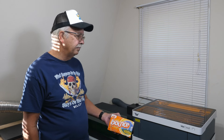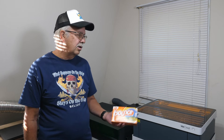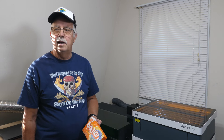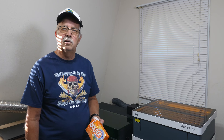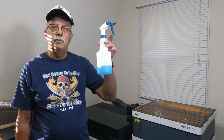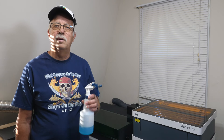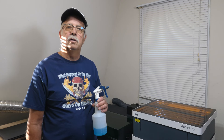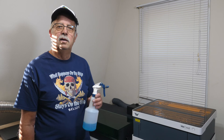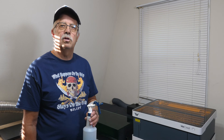When you're doing cutting with a lot of smoke and vapors, the acrylic is going to cloud up on the inside — both of them have that issue, same as my laser enclosures. Easy fix: use your favorite glass cleaner, a paper towel — make sure there's no grit or you'll scratch the acrylic — then once it dries, rub it again with a dryer sheet and you'll eliminate a whole bunch of those problems.